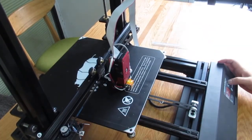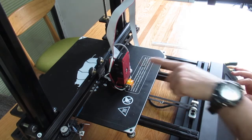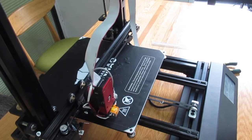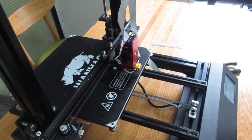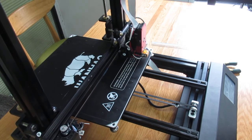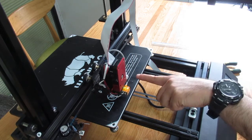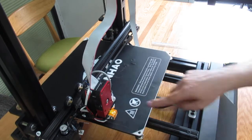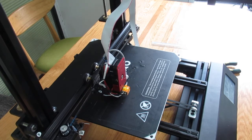So I don't know what's happening. I'm just trying to press auto leveling now and see what happens. And my light is on here. So as you see, once you have the sensor leveled and adjusted, it memorizes the distance between the nozzle and the print bed, so later most likely you don't need to adjust it after you receive the printer.